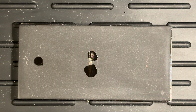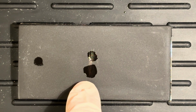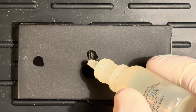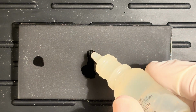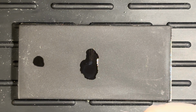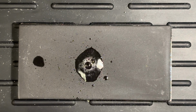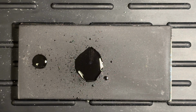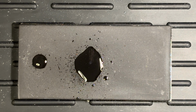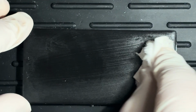Yeah, so this is 10 karat gold then, right? If I'm seeing this right, the 14 acid isn't quite doing it. I bet you the 18 acid would. Let's try the 18 in the middle here. Okay, so we know that's 10 karat. Handy to know that. Teeny tiny little dab of gold, but still. Gold is gold, isn't it?